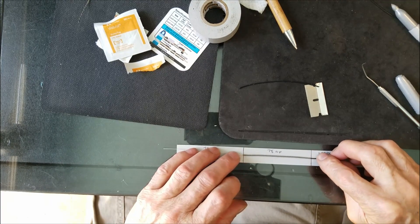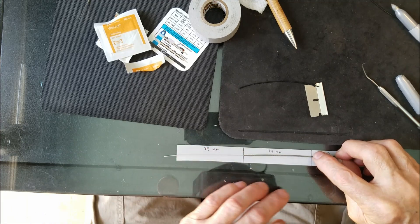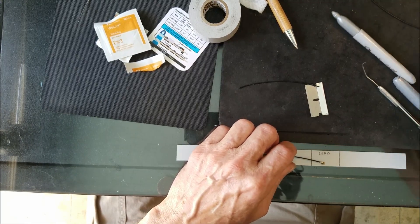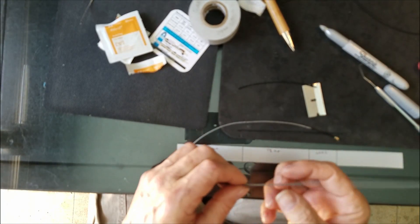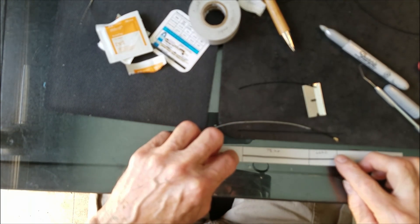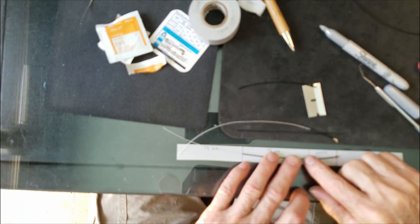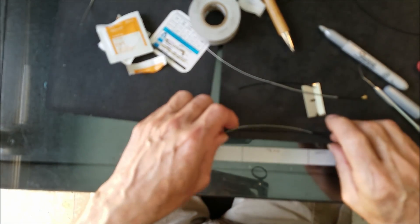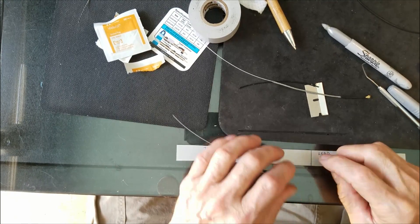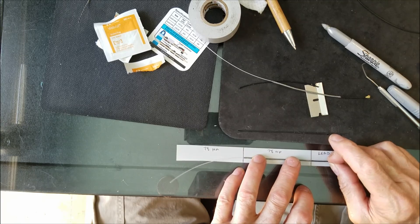Come back to your mark and measure — if you did it right you'll have exactly 78 millimeters. The last one I made I ended up having to trim a little off the ground shield to hit 78mm. On this one I just got lucky — the excess I left at the top worked out to exactly 78 millimeters. That was pure luck, not planning.